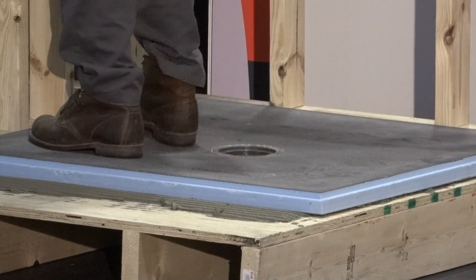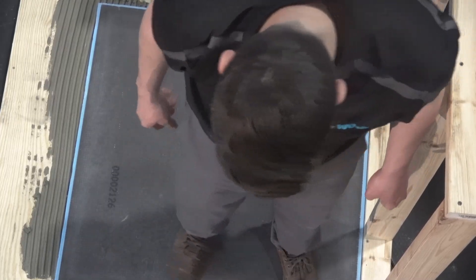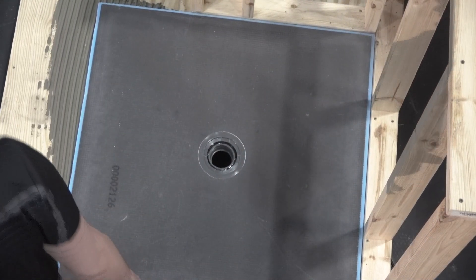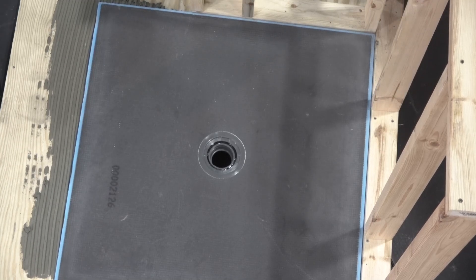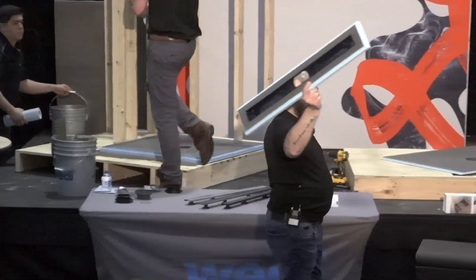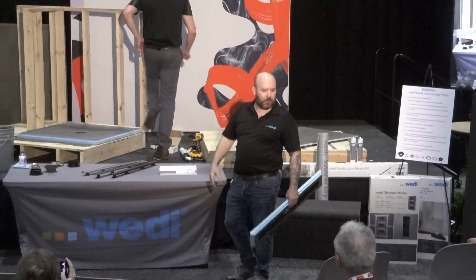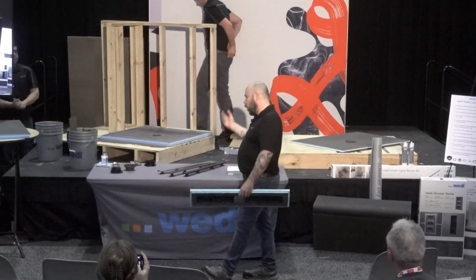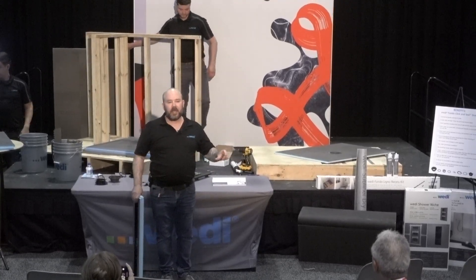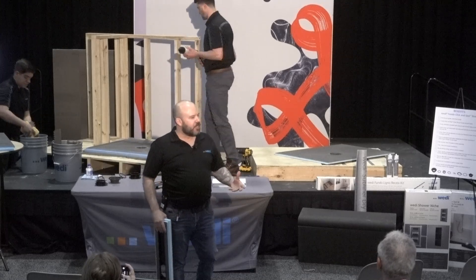On the other side of this mock-up we've got one of our linear drain offerings — that's the Riolito. That's a single slope linear drain, and it's a line module that doesn't get easier than this to set. With the drain covers for the linear drain, we have matte black, stainless, and tileable. For the four by four point drain system, we also have matte black, chrome, chrome designer, gold and brushed gold, and the list goes on. Tileables are quarter-inch, three-inch deep.